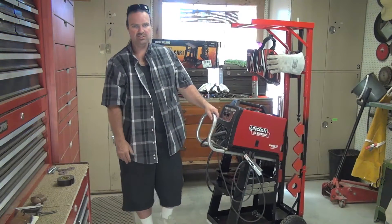Depth with the handle is 32 inches from the back wall. Height is 66 inches from the floor up to the top. As for width, I stayed within the same width as the cart — I didn't go any wider; the wheels are 3 inches wider on both sides combined. An important design decision: I did not add anything protruding from the back, so as you walk past, your shoulder never hits or gets caught on anything.